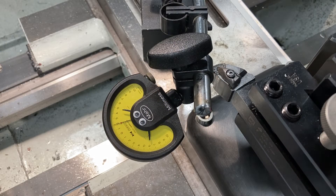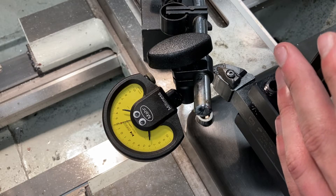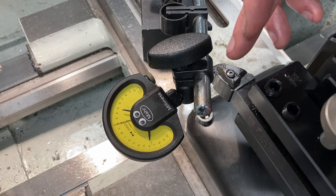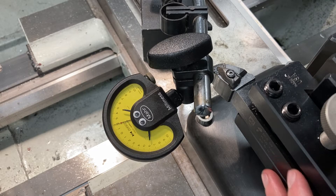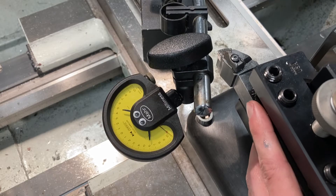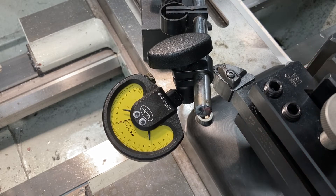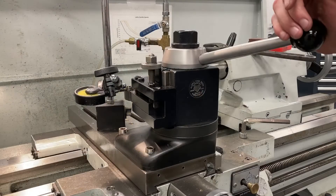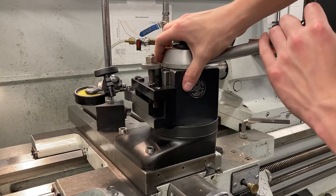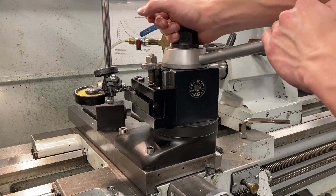So let's do an actual test of the angular repeatability of this setup. I've got the indicator set up on the tip of the tool, so we can see the real displacement error measured from where the tool will actually be cutting. Take note — the indicator is sitting right at the two mark. I'm going to take it, index it seven and a half degrees to the next position over, move it back, and we're within 20 millionths repeatability there. I'm really happy with how this turned out — it's basically exactly how I imagined it would be. Can't wait to start using this thing. Thanks for watching and I'll see you next time.